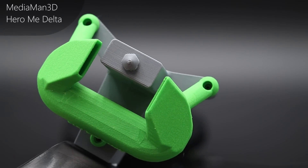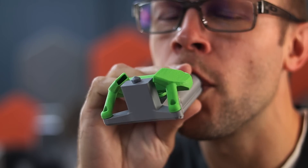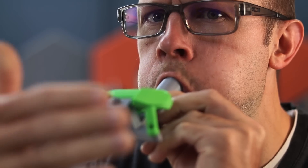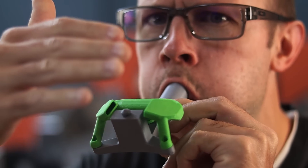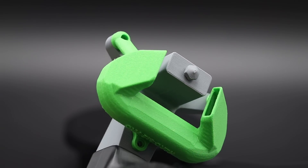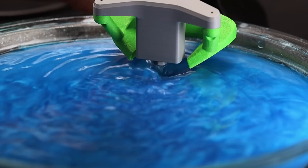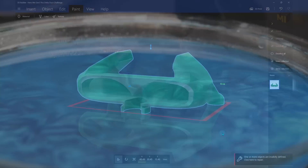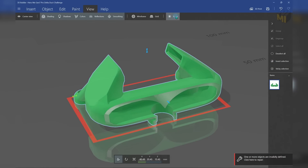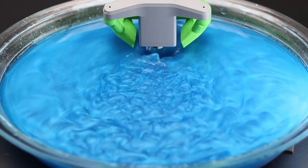Next is the Hero Me Delta designed by Media Man 3D. This one printed nicely and has very little restriction — almost no noticeable resistance when blowing into it. It has very good visibility from the front, which is nice especially during testing. It's compact at 14 grams with a refined semi-geometric shape. It features a dual opposing port design with ports set back from the nozzle, directing air forward and down, plus an integrated diverter below the fan supply inlet so streams from each side meet and direct air forward toward the front of the printer.